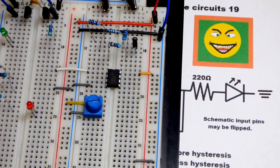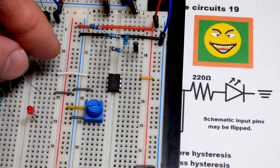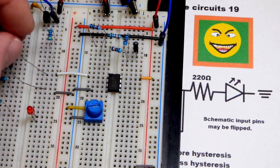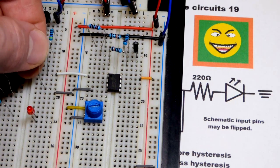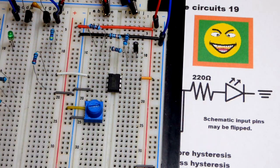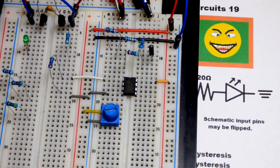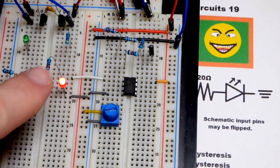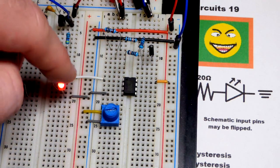The load comes from the output via a jumper. I'm taking a 220 ohm resistor - for 5 volts that protects the LED. The long lead, the anode, heads toward the output because we want it to light up when the output is high, and the cathode goes to the negative rail. In a previous video we wired it the opposite way where the output went to the positive rail.